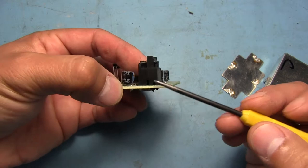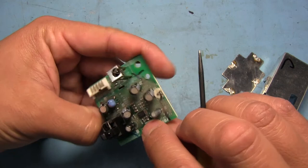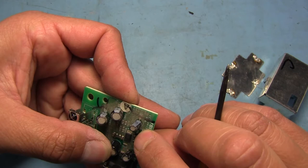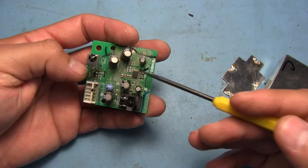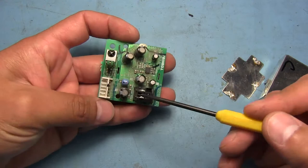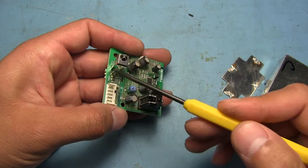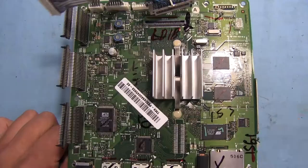Nothing underneath that little tower — the light just goes straight through. Let's see what this chip actually is — it's made by JRC also, and that is a 2115. No surprises there — that's just an op-amp for this sensor. It makes sense to have one here because if you run long leads from the sensor to another board, you're going to get a lot of loss. This sensor type is very typical for the type used for remote control infrared pickup. So that's it — that's what's on that board.